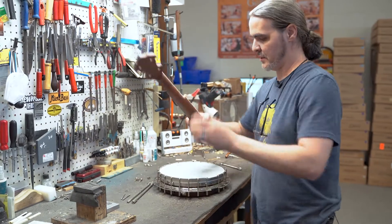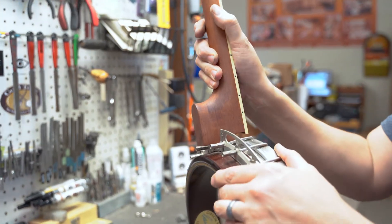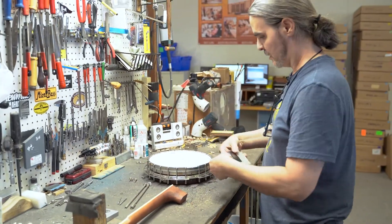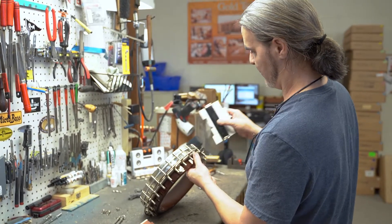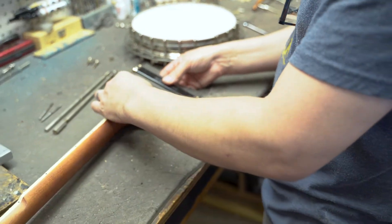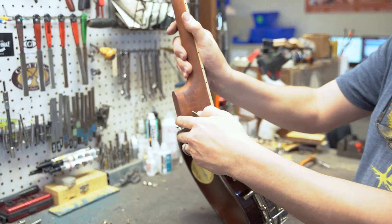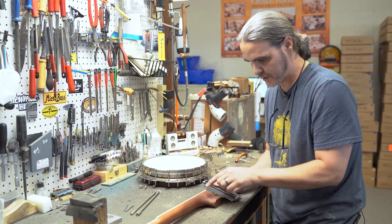First thing we got to do is cut out a flange hole in this neck and give it a basic fit first before I really fit it. First thing we're going to do is take an impression of the wall that I'm matching this neck to. I'm going to set the neck just ever so slightly above this counter hoop here, just ever so slightly up there. When I do my drawing on here, I'm going to make up for that by putting this shape a little bit lower.